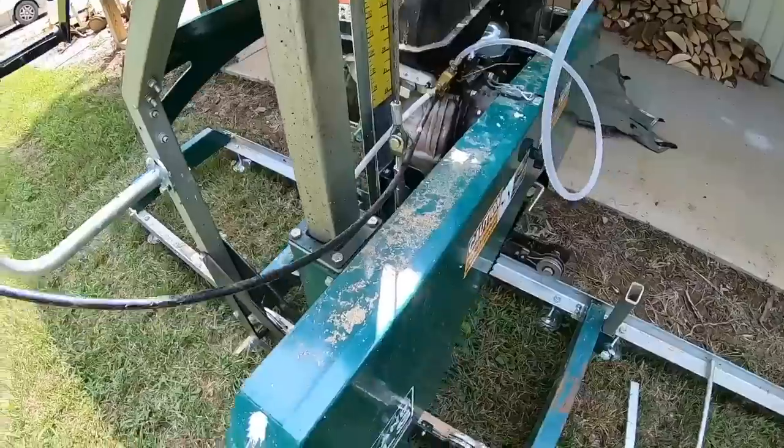Now, if I was going to buy my own and set this up, I'd do a more permanent setup. I'd probably pour some concrete sections, not a whole slab, but some concrete footings that this could sit on, that would be perfect for a very long time and be easy to adjust if we needed to. But for the time being, we're going to have this for about 2 months through September is what he was talking about. We're just going to run some timbers underneath, and I think that'll get us close enough.